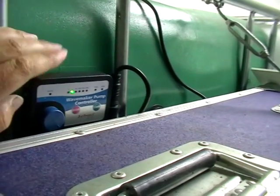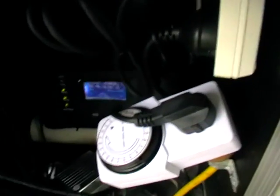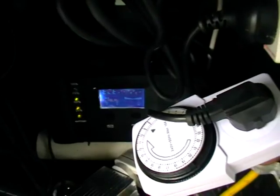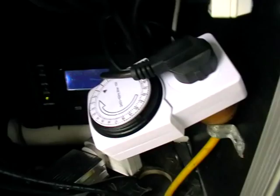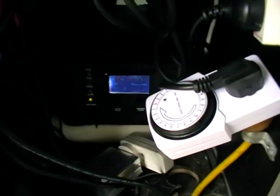The pump that runs this is about 35 watts. So the 125 watt panel and the two batteries in parallel going into that controller handle with no problem 100 watts of pumps plus another 35 watts for the wave maker. And if I wanted to, I could probably plug some air pumps in as well, but the older system handles all the air.